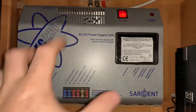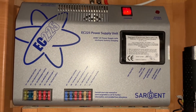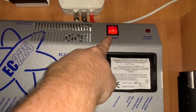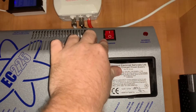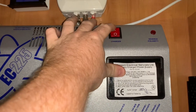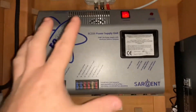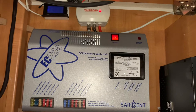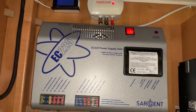Now inside this unit is also your mains powered battery charger, and you'll find here we have an on/off switch for that charger. When the charger is on, the switch illuminates — as you can see, I've just turned it off and the light has gone out, I flick it on and the switch illuminates. So at a quick glance I can very quickly tell that not only do we have a working mains supply, but also that the charger is powered on.